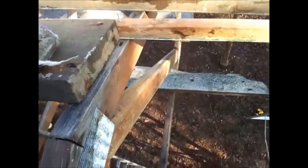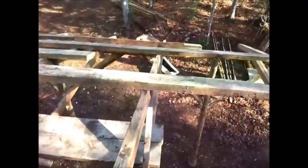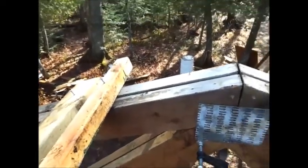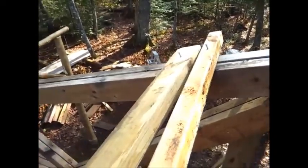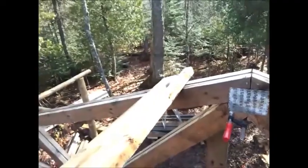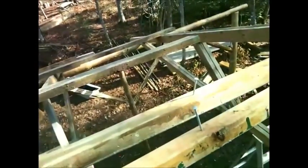One more thing — here's the next step. I've got a ladder set up against the built part of the roof, and I nailed two boards to this secured truss. One nail is in the further truss and one is in the closer truss. So now I can unclamp them and they're both secured independently. I can take off the tripod and the lever board. Then I can move them independently — I'll move the inner one in first and get it secured to the purlins, and then move the outer one out using these boards.